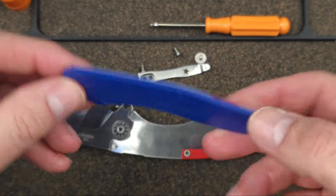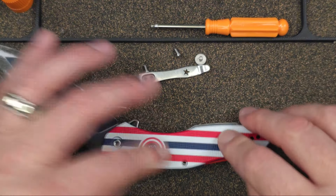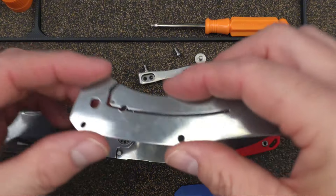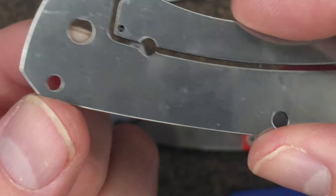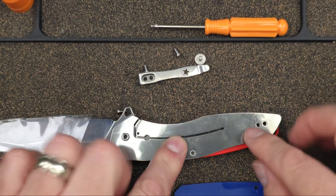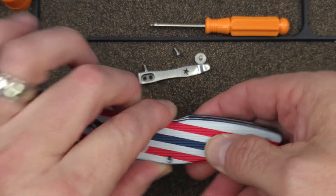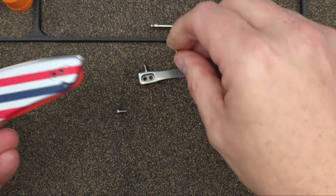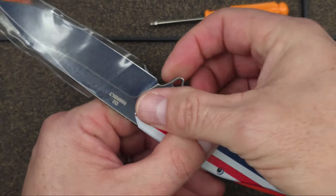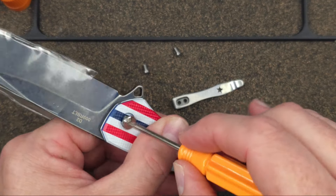Now we have this scale — I'm going to put it on like this and match it up with the back spacer holes. Wait, I forgot my liner! See how the liner has the D-shape right here — that's what's going to keep it aligned. Line it up, match it up with your standoffs. Everything is clipped in — make sure everything snaps into place just like that. Now I can put this on, squeeze it, make sure everything's lined up. Now we just have our pivot left. The orange one is your T8 — that's going to fit your pivot.